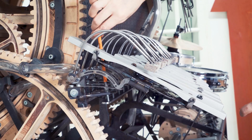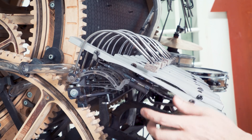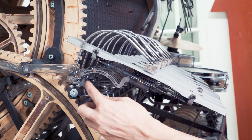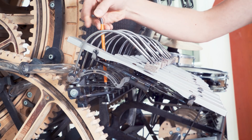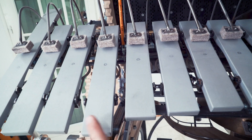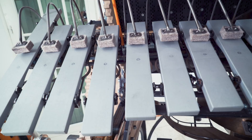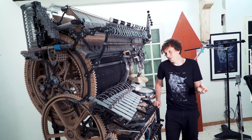I'm totally free to use whatever spring steels I want — I can use the easiest ones for maximum movement when the marble hits them. And if they get a little fatigued over time, we just go in here and give a little clockwise turn of the set screw. You can see how the plate falls down and comes back up. Seventh time's the charm on this solution.